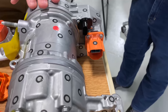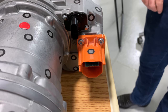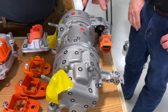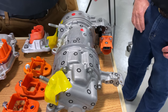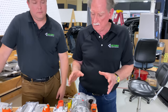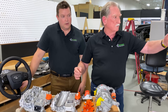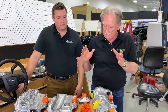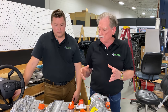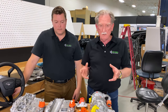The AC compressor connectors are provided by a supplier, so this connector is similar to what we saw on the Ford Mustang Mach-E components — four fasteners going around, very similar in style. When we look at everybody's stuff, there's almost nothing for Tesla and all this other stuff over here. But that's what happens when you get into an integrated type of design where a lot of these modules don't have to have their own separate connectors. That's the best way to do it.